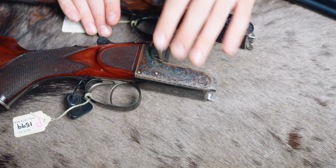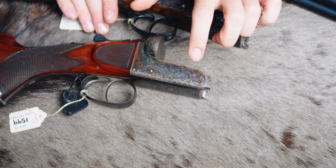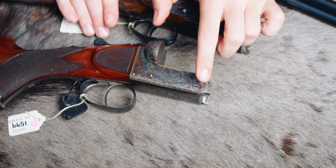What's interesting is what you're left with is a very beautiful look, and something that still fascinates gun owners to this day. As much as it fascinates us, it also polarizes us. So you'll find guns that have the case hardening, and then you'll find some that are bright finished. They'll have that colour taken off, but that still doesn't remove the carbon. It's just polished, essentially, whilst then retaining the hardness and all the qualities they were looking for by doing it.